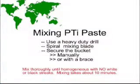In this section, we will review mixing the PTi Paste. You will use a heavy-duty drill with a spiral mixer. You will secure the bucket either manually or preferably with a brace. The product will be mixed thoroughly with an up and down motion, periodically scraping the sides, until a homogeneous mixture is achieved with no streaks, white or black. The mixing will take approximately 10 minutes.